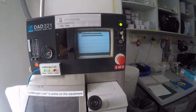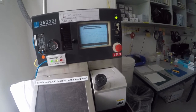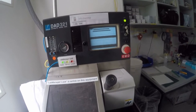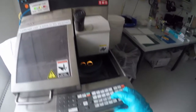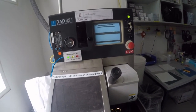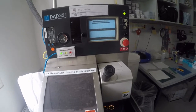Often you are way off with the hairline after a blade change. In that case, you need to move it. It's usually easier to look in the microscope direction. Adjust just the width of the hairline — use hair wide and hair narrow. When we are finished, press the enter key. Then it says the correction is larger than 50 microns — that's okay, because we have changed the blade.